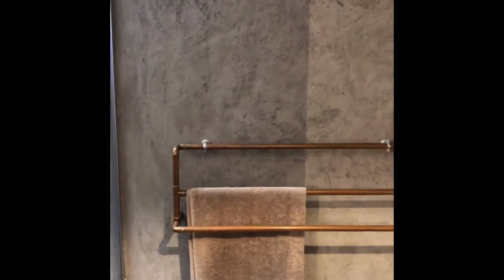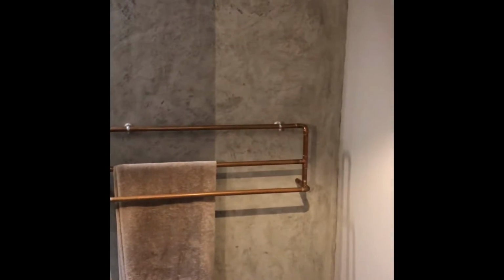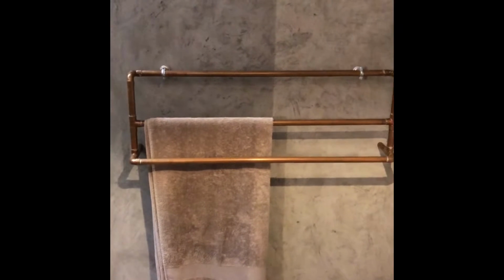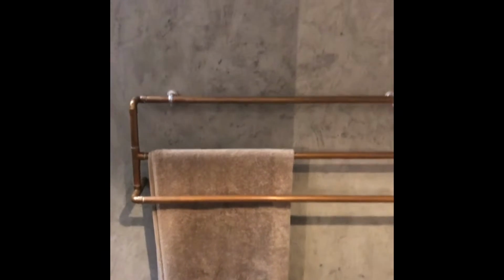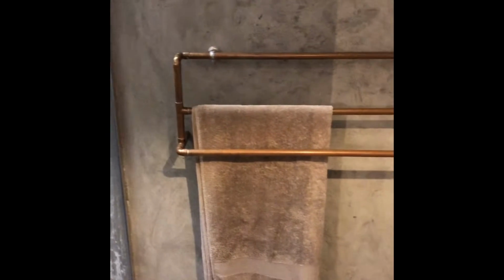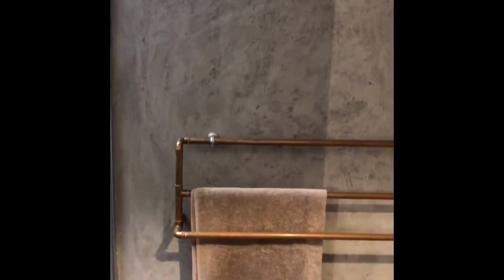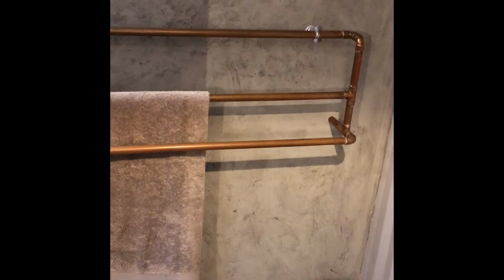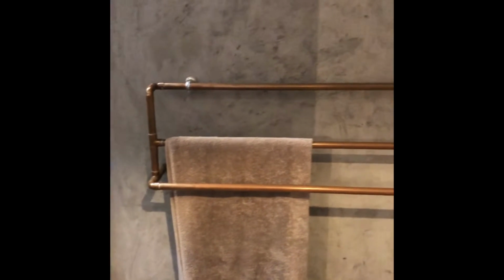So now the actual wall here, as you might have noticed, is a bit different. It's a cement effect wall. I wanted one of these, and I did look at a few products on the market which seemed really expensive for a small tub. So this was actually bare plasterboard or drywall, and all I'd done was make a combination of cement, normal grey cement powder, some normal white paint and some PVA glue. Mixed it up, did a few trials to get the right balance of paint and that, and I just painted it on the wall. It's really rough and gritty, and you just go over it with a nice new shiny trowel, and it gives you this great cement concrete feature wall. So that was great, didn't cost a penny.